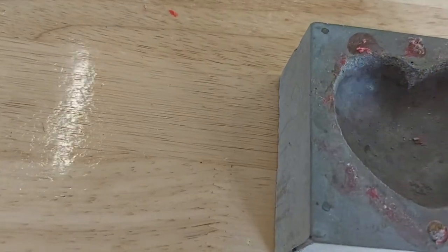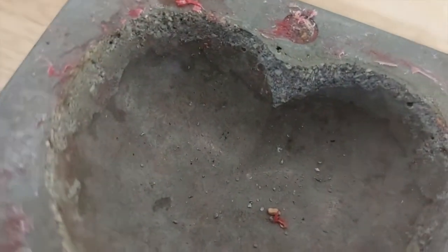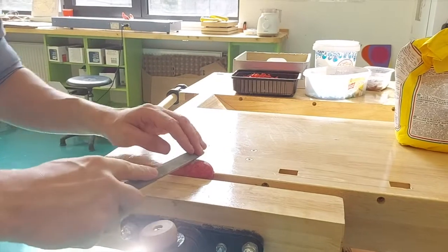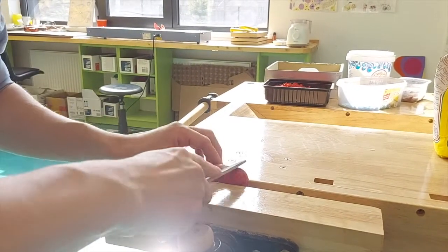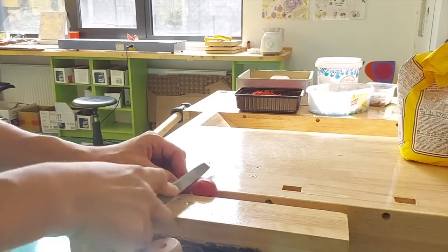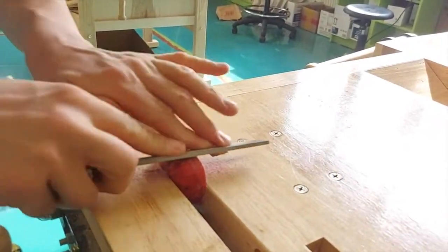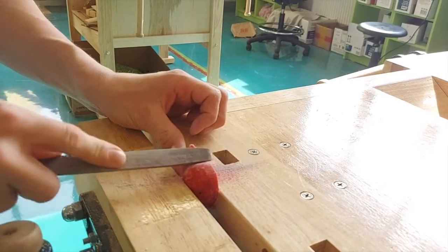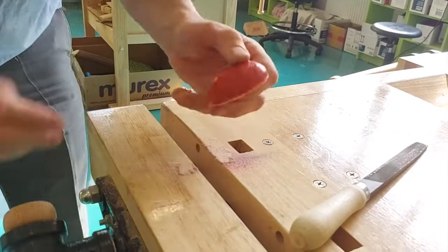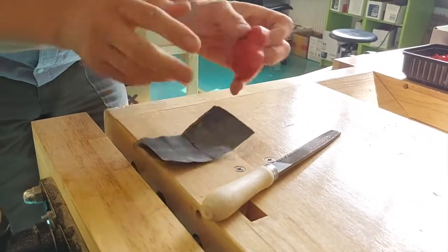What I would do now is polish this mould if I wanted to use it again and put a little bit more sealant around it, because it's only the top layer that has broken off. I can get a file and file the edges to make it nice and smooth and to get rid of some of that concrete that got stuck inside. Then we can polish the edges with some wet and dry paper to make it look a bit more professional.